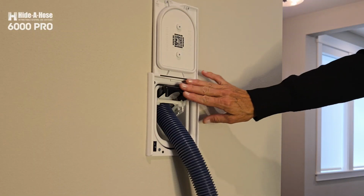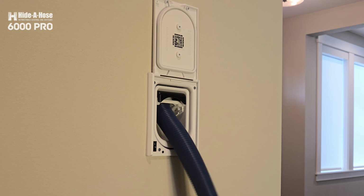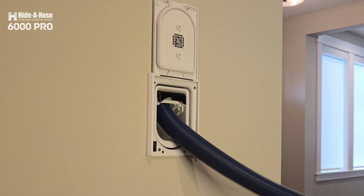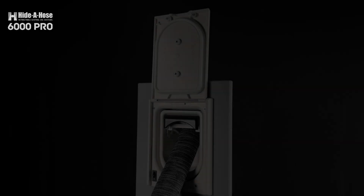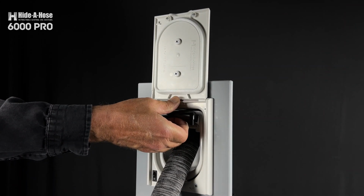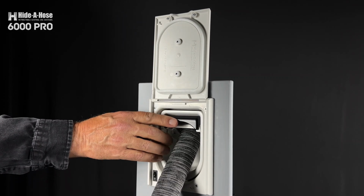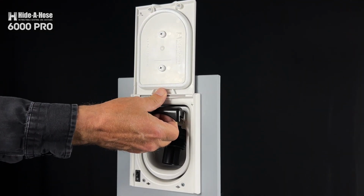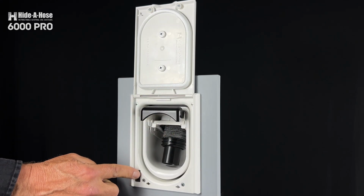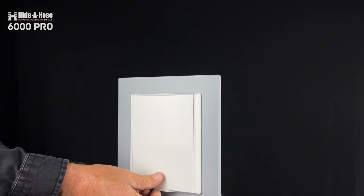When designing this valve, we thought long and hard about alternative ways to make a lock and seal. Although we could not come up with a better concept, we did find some ways to improve it. The most noticeable change is the new push and pull locking lever. In the testing we performed, people generally found it more intuitive and easier to use. The other key feature of the pull lock is that when the door closes, it pushes the lever in, so you cannot close the door with the valve in the locked position.